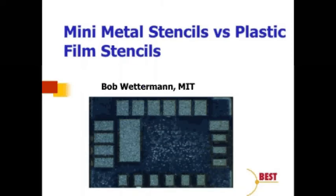Typically we have framed stencils, under tension, that print our entire board — albeit with no parts on it. We've shrunk that down, taken away the frame, and just done typically site locations only with these miniaturized metal stencils, then printed solder paste, placed the component, reflowed it, and the device was reworked. We typically did this for devices we could not hand solder: SMT devices with bottom-terminated components, area array devices, ultra-fine pitch devices and the like.